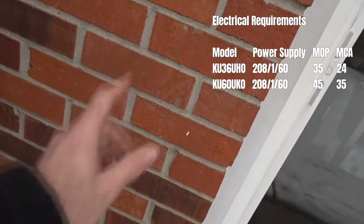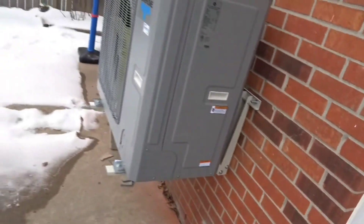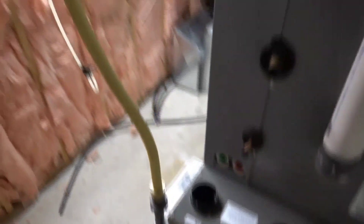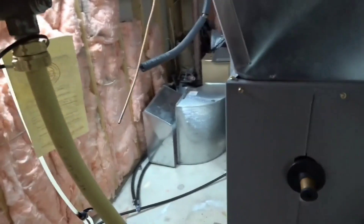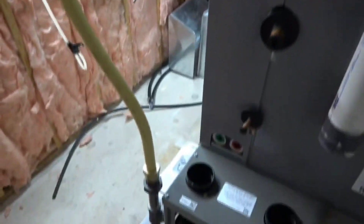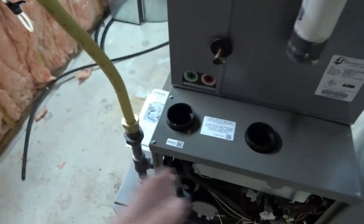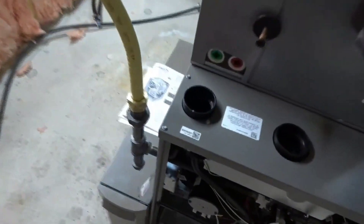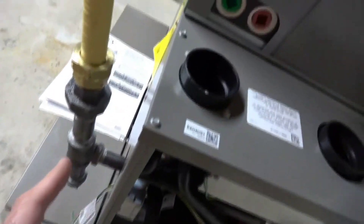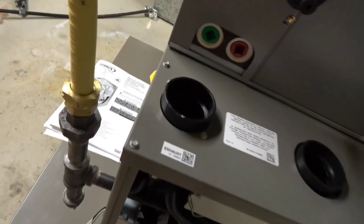We're going to mount the disconnect on the wall here and then feed our whip from the disconnect into the electrical — that will be our next step. What we've done so far is install the furnace and the filter cabinet and we've fastened in our gas line. What we chose to do here was use some gas tight — just make sure to look up the code. We used gas tight because our pipeline moving down and the pipeline here with the furnace didn't match up. Make sure you put your drip pocket in and also a union, because you want to crack the union to remove it and not the gas tight where possible.